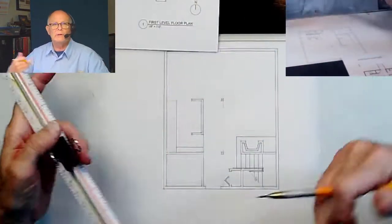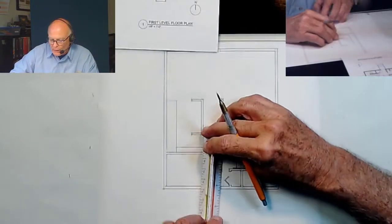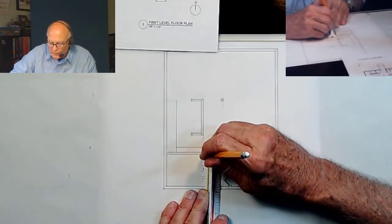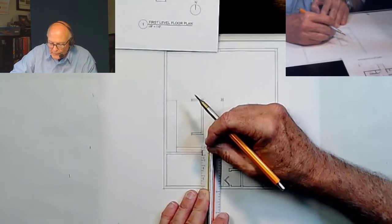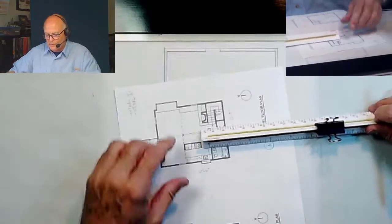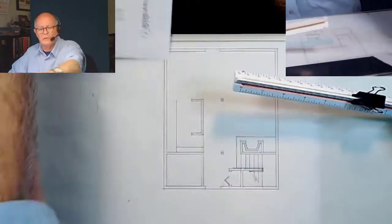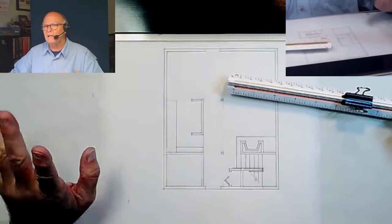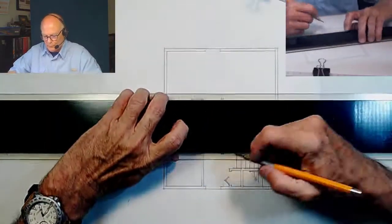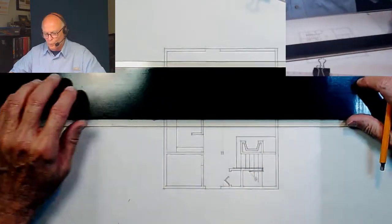Well, as we looked at the doors provided at the entrance, we're going to apply the same rule of a 2-inch offset for the jamb in the frame. And then we're going to put in a 2-foot door. And we're going to double check that real quick just to make sure. Yes, it's a small door. Usually they can be a little bit bigger than that, but for this small plan, this is quite adequate. So I mark that, and that's where the door opening will be.